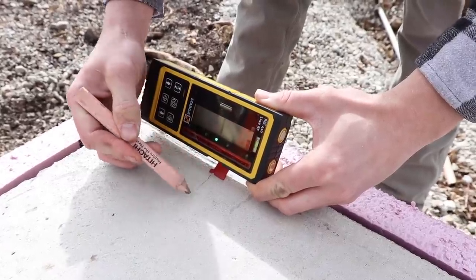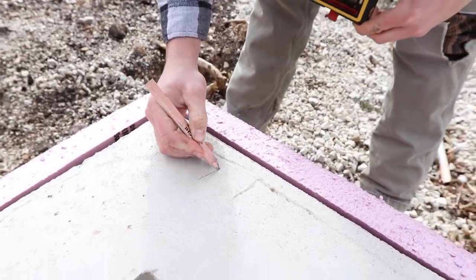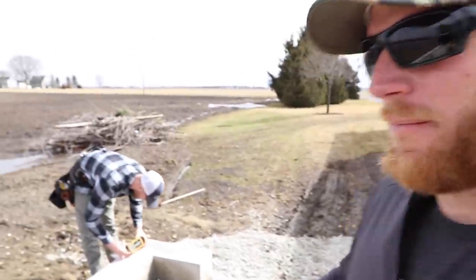Now that dimension that Greg just marked was just an arbitrary six inches off of the outside edge of the wall, because obviously with this wall here we've got these random pipes - we couldn't run a line exact. So we just do an arbitrary number off of that wall to get that parallel line established, and from there we'll mark back to find our exact dimension.